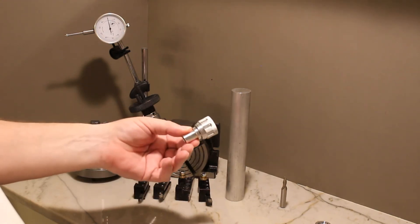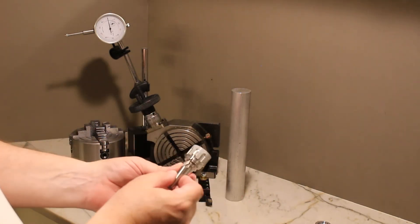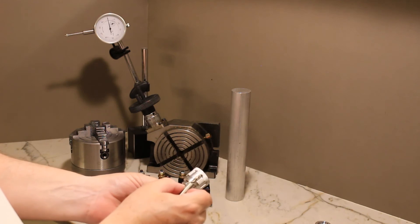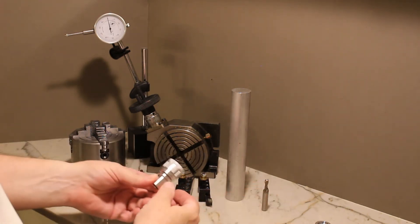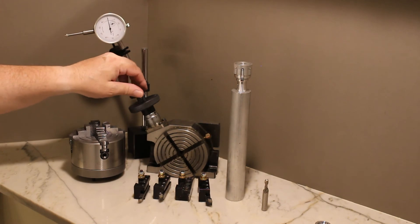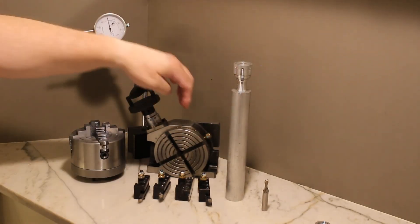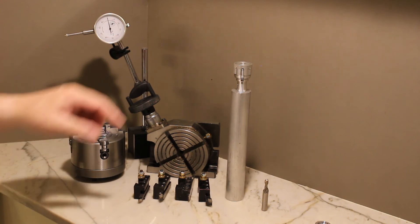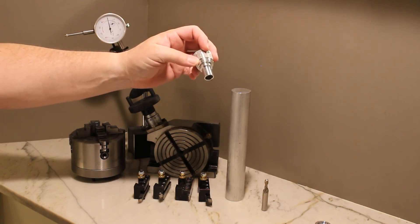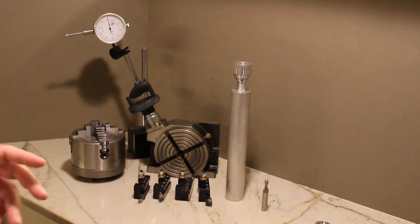One of the things you have to do after you put the knurling on — which is done with a knurling rig — is take your end mill and mill eight little flat spots evenly around the knurls. To do that you need this gizmo: an indexing table, a rotary table. It comes with a tail stock, and you mount the rotary table and tail stock on the mill, which allows you to turn the part around and get the flats spaced exactly right. This particular one is a reject because I didn't get exactly five knurls exposed.